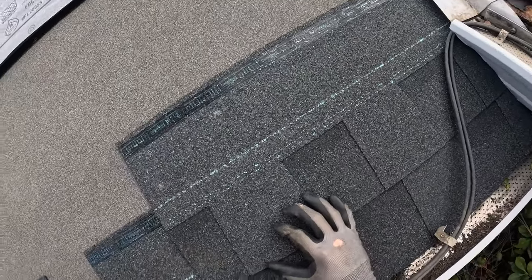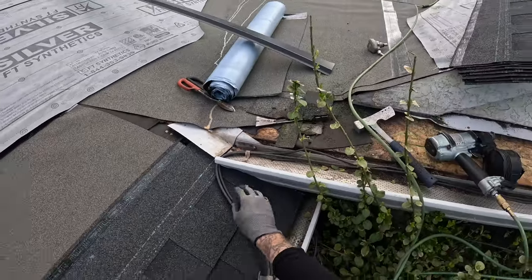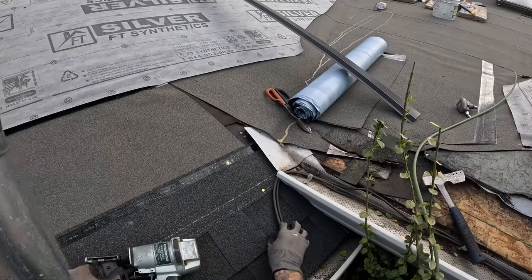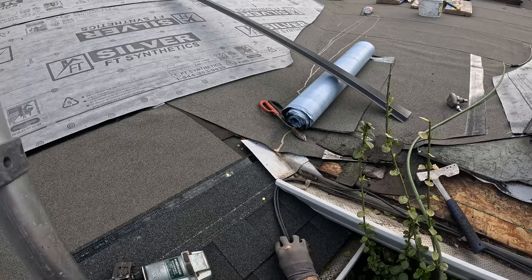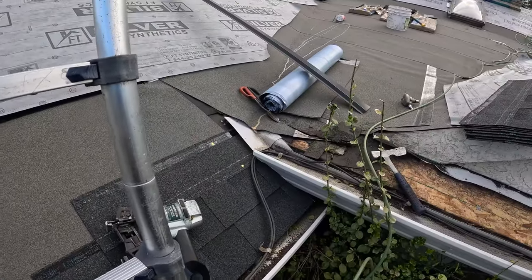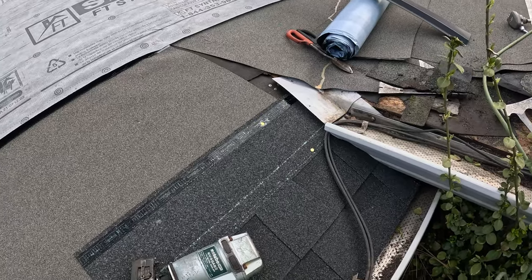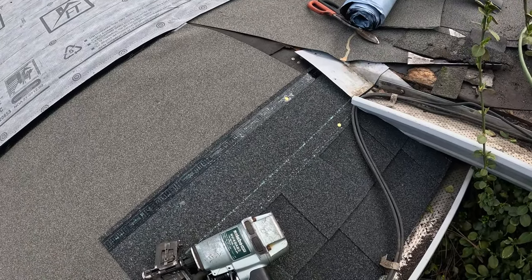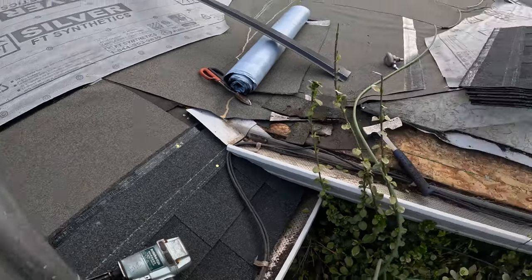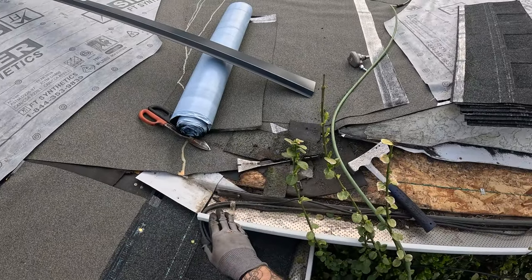These shingles — the bit is a little short here, so you've got to be careful when you're shingling because that sometimes happens. It's one of my pet peeves but it's mostly a manufacturing thing and mostly cosmetic. If it was really bad and noticeable I would swap it out, but I'm not going to start turfing shingles just because of that. Alright, so now we've got our steps — shingles are tight against the metal.